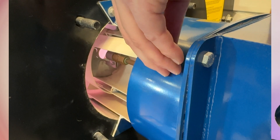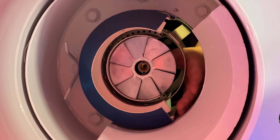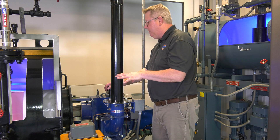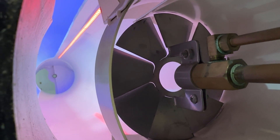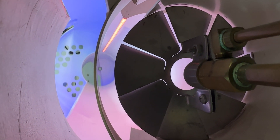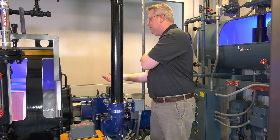In the full back position, we divert some of that air outward and through a secondary annulus, and the benefit is that we get less turbulence. So if we were only going to operate a burner at low fire, we might want it to go through the diffuser because we need as much mixing energy as possible. But if that becomes loud as we go to high fire, we might need to put more secondary air in so we get less turbulence in the flame, because we've already got plenty of mixing energy.